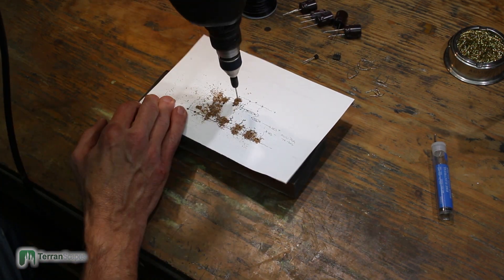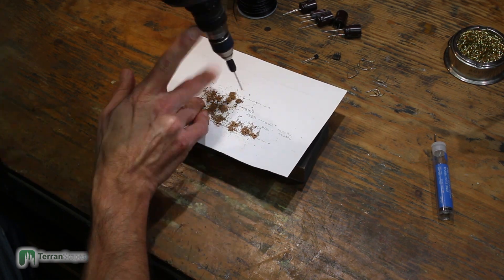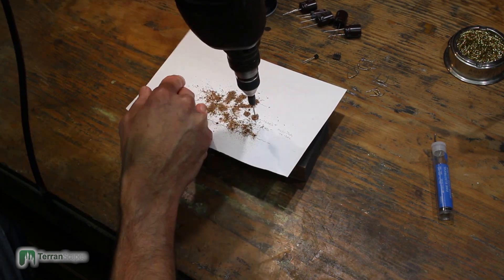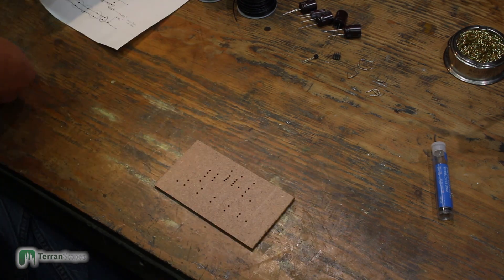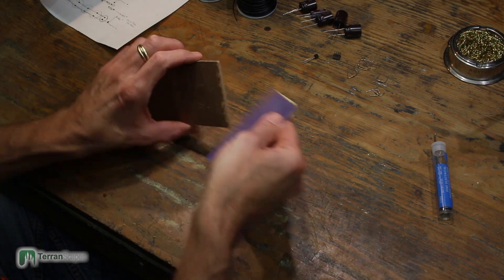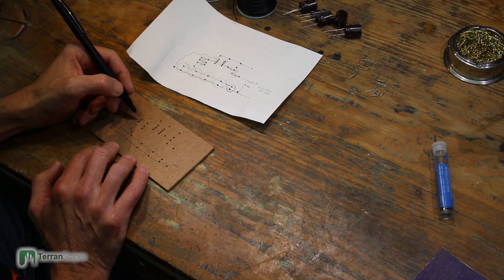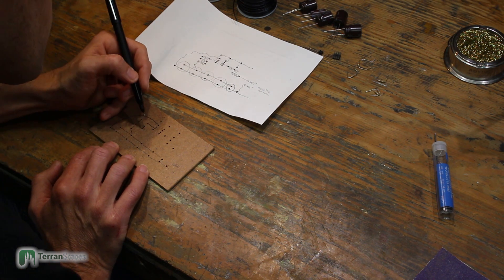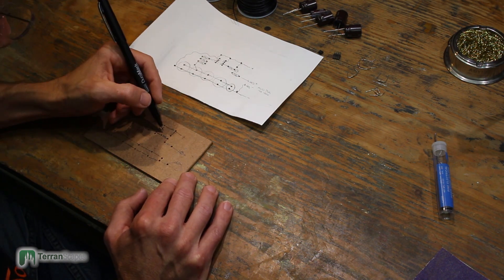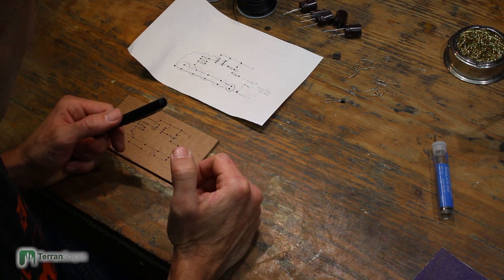I've drawn it out on a piece of paper and spaced it for all the components. For the 555 timer chip, which is the backbone of this circuit board, I could mark exactly where the pins are and where the capacitor pins are, so I've drilled out those holes so everything fits. Then I label it to follow the diagram I created, because once I start looking at all those holes on the board I don't actually know what they mean — I learned that the first time I tried this.